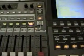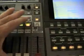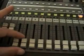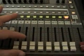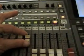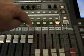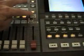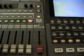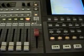The first thing I do once it's started up to set it up for recording is to turn all the input channels up to 100%, which is the bolded line, 100% or 0 dB. You turn them all, 1 through 8, and 7 and 8 is on 7, and input channel 8 is actually on 9 and 10. Then you turn it back to track, which is your output tracks, and we turn them all down, the ones that we're not using. And then let's turn up the master volume.